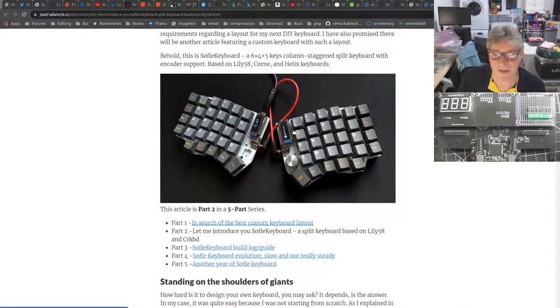But underneath these are two microcontroller boards, like ATmegas or something, small microcontrollers. So this has two of them on, which is ridiculous. And then this jack between them. And these jacks carry, I think, I2C and data.